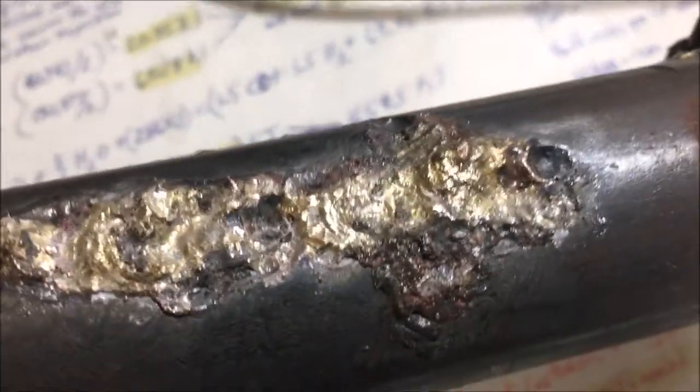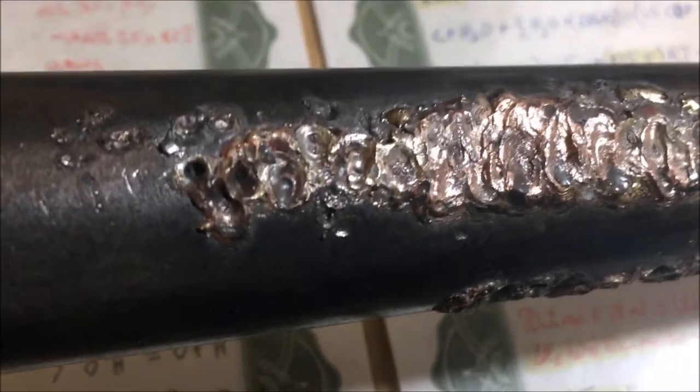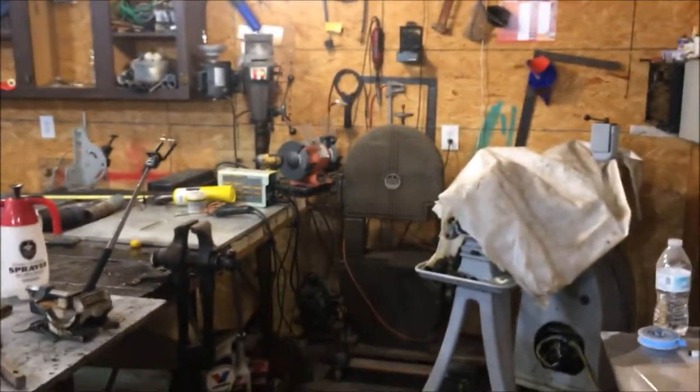This here, I think, is some of the stuff where I tried just the wand. I didn't go back over that with the carbon rod, I don't think. This one here was done with the carbon rod and the brazing rod in tandem, and it was washed over with just the carbon rod to kind of seal the deal, so to say. It appears that it did in fact take. Now, I don't know of any scenario where you would want to do this. I just wanted to see how good it would work